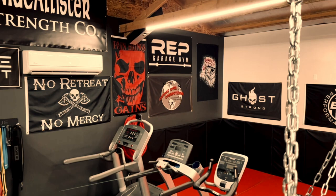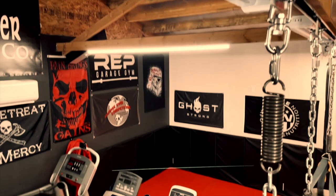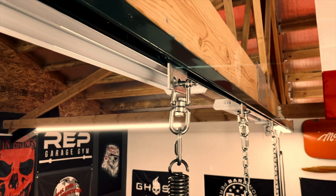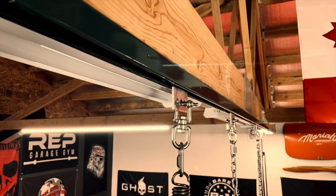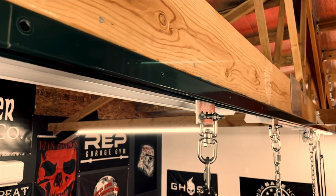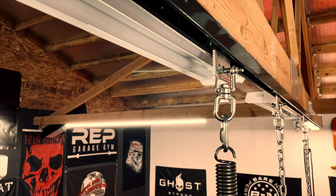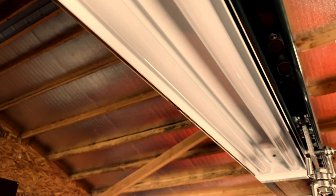Alright, going up the ladder — I'm going to show you how the rail is attached. There's the rail right there. You can see it extends. I basically screwed it to the bottom of these trusses right here. You can mount yours differently, but whatever you do, make sure when you're screwing it up, you tie into wood. Make sure you're not just drilling into drywall. You're going to want to hit structure — go up in your garage or up in the attic. Just make sure you're tying into some structure. Let's look underneath — I'll show you how I did that.